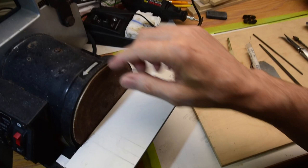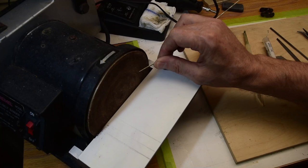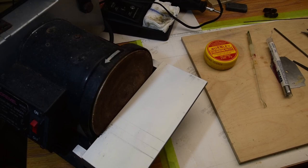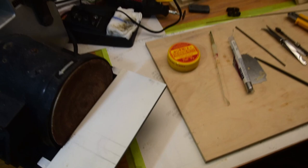Not necessarily with turnouts all the time. When I get lazy, I use it, like if I want to start a frog angle initially, like this. Then I clean them up with the hand file. And then I custom built a welded-up base plate, because the other one, a cheap cast aluminum thing, I threw out, and this one's nice and rigid and square. Every once in a while I'll paint it white so I can put marks on it. Okay, so those are the tools that I use.